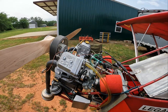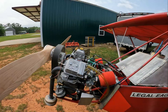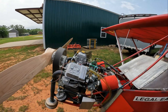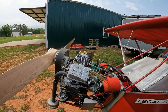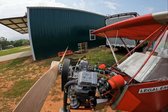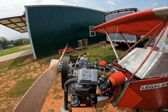The performance on a typical day — I'm seeing roughly 200 to 250 feet per minute climb, which is nothing to write home about. My Verner-powered orange airplane under similar conditions gives about 350 to 450 feet per minute, and with the Verner on the front of this airplane, I'm seeing about 400 to 500 feet per minute.